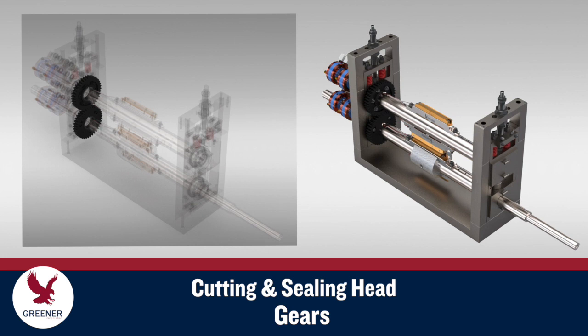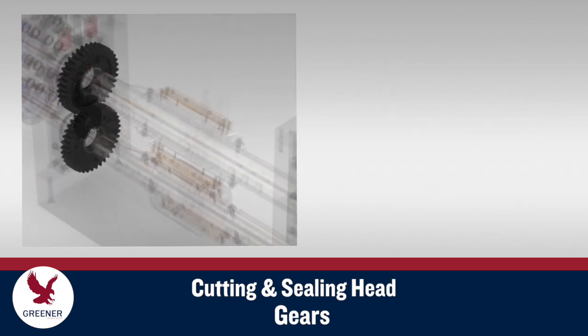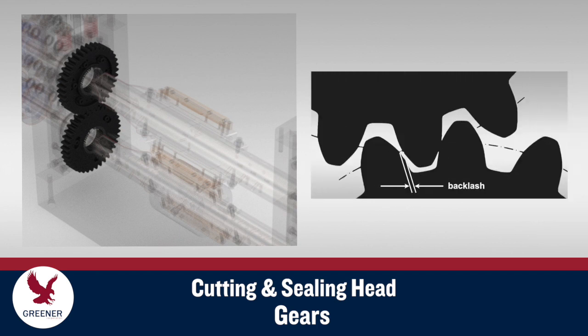In most cases, the upper gear can be adjusted to spin the upper shaft independently of the lower shaft to ensure proper alignment and facing of the sealing jaws. A split or anti-backlash gear can be adjusted to remove backlash or free play between the gears, which causes misalignment of the sealing jaws.